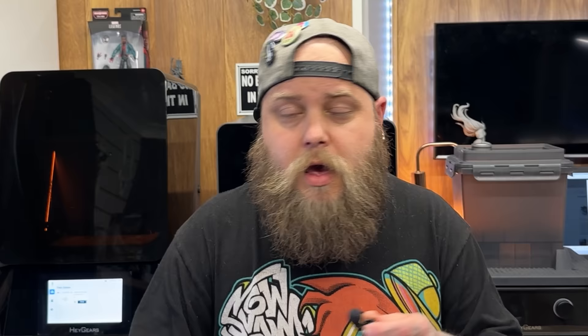Hopefully this video inspires you to explore different avenues of 3D printing — particularly the Heygears Ultra Craft Reflex system. The resin itself is super flexible but also maintains rigidity, and it's really strong against impact. It takes screws very well, and this kind of resin is something I would use for engineering miniature parts for my tanks and remote controlled builds. One very important thing when making stuff like this is details, and this machine packs all those details in with the great resins they provide. I also need to mention that none of these parts had any shrinkage that I noticed — maybe at a scientifically microscopic scale, but parts fit perfectly and gears meshed together really well.